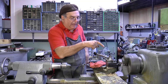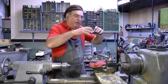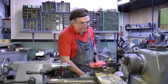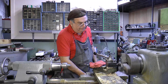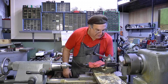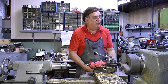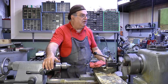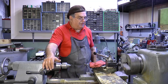One thing I've got to mention is I've got a piece chucked in the middle there — you can see it, any kind of stock. They make little rings, a bunch of washers, and they get like $200 for the set of washers. You can use anything. So we're going to go back to zero and get the eighth of an inch out of there so we're close. I'm just roughing it now with this heavy-duty tool. That's 100 thousandths right there.